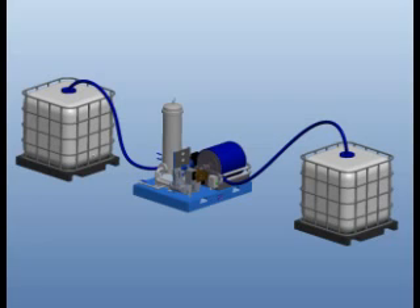There are a number of ways to connect from tote to tote. Micromatic top to top filling is recommended in applications where 35 GPM or less is acceptable. This closed loop system is ideal for maintaining DEF purity.